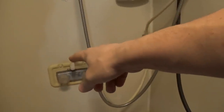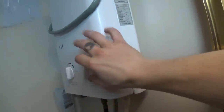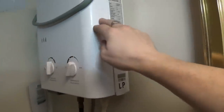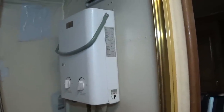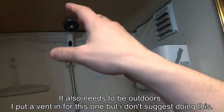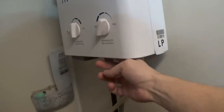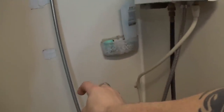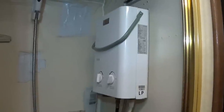This is my current setup with the only water heater I have. I run a line from the hot and cold valves for the shower head. I turn on the cold water and fidget with the valves until I get the temperature right. It's a little finicky - there's no tank so when you turn the water low it shuts off to prevent boiling. It's great for showers since the pressure stays consistent, but for sinks turning on and off the hot faucets is hard on it. If I shut off the tap without turning the switch off first, the propane flame takes about a second to shut down and I can hear it start to boil - so it's just not the best option for running throughout the entire RV.